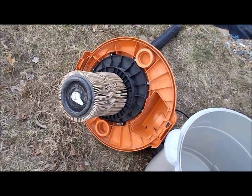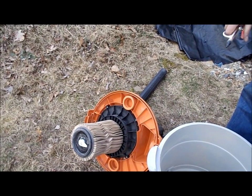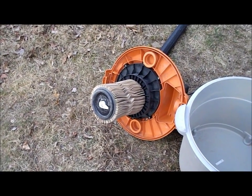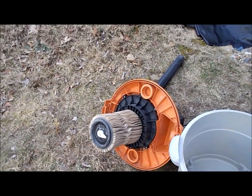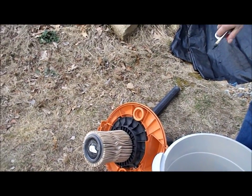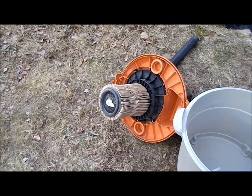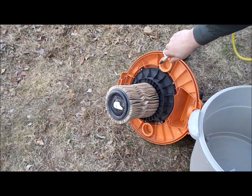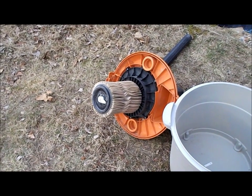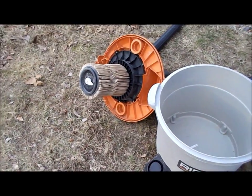There is some of the fine powder that has settled into the filter. So the conclusion is the really fine wood flour is ultimately being stopped by this paper filter. I'm going to hit it with a little bit of compressed air to give you an idea that there is a fair amount of dust on it. Before we ran this test, we blew everything out with compressed air to get it about as clean as we could, so that gives you an idea of how well this worked.